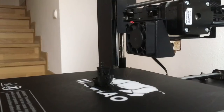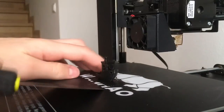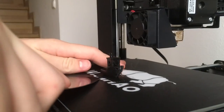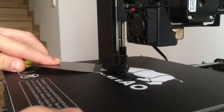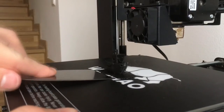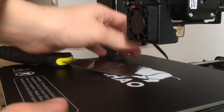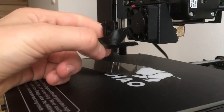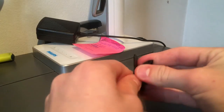And now, to take it off, I would never recommend you to use your hand, because there's a high chance of it breaking and the support staying on the bed. So instead, use a scraper, like this one, and just try to find its weak spot. Like you see here, I'm just trying to find the weak spot from how it is set, and in a few seconds, see, I found where I can pull it off. And it's very good because it's stuck to the bed sheet, but it doesn't stay like glue.